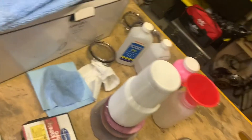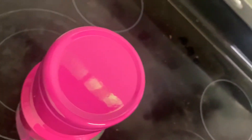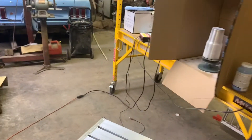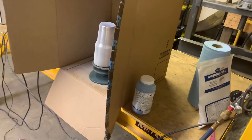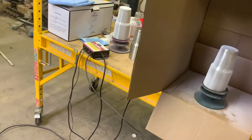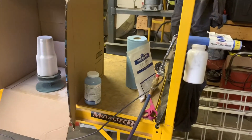Got the front of these two done in white. These just came out of the oven and they look pretty good. We're gonna let the oven come up to 450 and put those in. We're not gonna cure them all the way — pull them back out, do our decals, throw our blue on there, throw them back in the oven, and then after that cures, we'll let them flow, pull the decals off, put them in there, and let them fully cure.